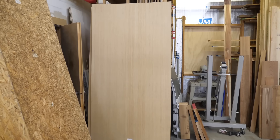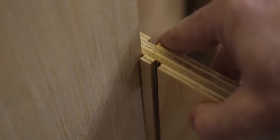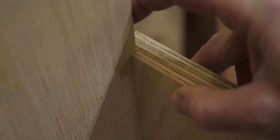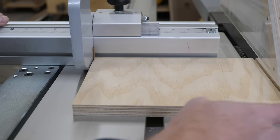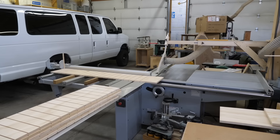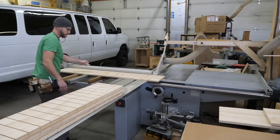This is called Revolution Ply, sold at Lowe's. It's sold as five millimeters thick — at least they're close on the thickness. If you want to break your brain, read the product certification literature for this plywood — it's comically convoluted. Anyway, rest easy knowing it's made from 100% plantation and sustainable wood sources and contains less than 10% birch. My one-quarter-inch dado is too wide for the five-millimeter thickness, so I'm making two passes for each shelf slot for a snug dado — making a cut, adding a spacer, then making another cut. It was a complete pain, but once done I was happy with the results.